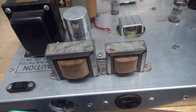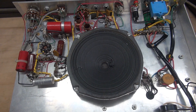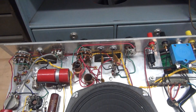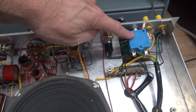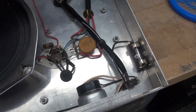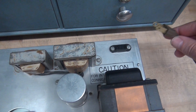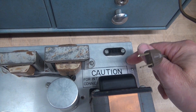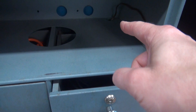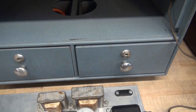There is the built-in speaker — we'll go bottom side. I believe we have a couple of chokes. Main power transformer, filter cap. The first thing you see is this big six-inch built-in speaker, and the sound goes out of that hole — probably comes out of the drawers. Original filter caps are still installed. There's a circuit breaker — I believe that's for the filament supply. Built-in fuse right there. She's super clean; doesn't look like anybody's ever been in here. There was an interlock that has been bypassed with that fuse. It used to be that opening this drawer would trigger a micro switch hidden back there and shut the unit off. Since these drawers like to pop out, that would be a problem, so it's been bypassed.